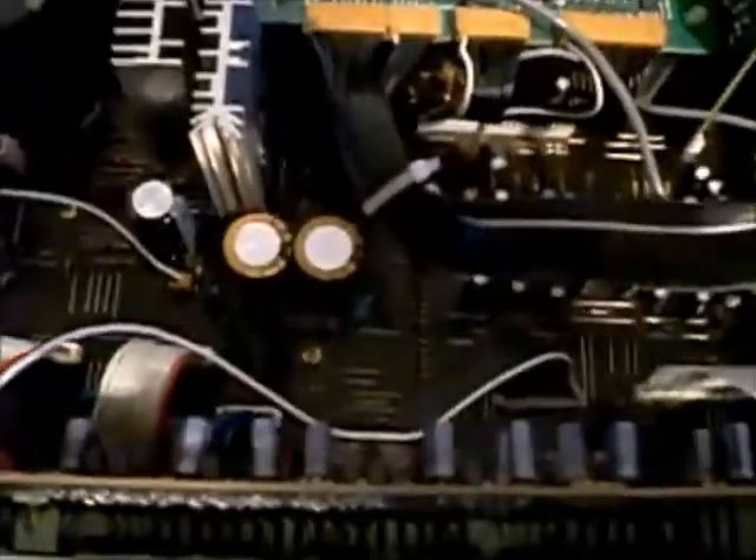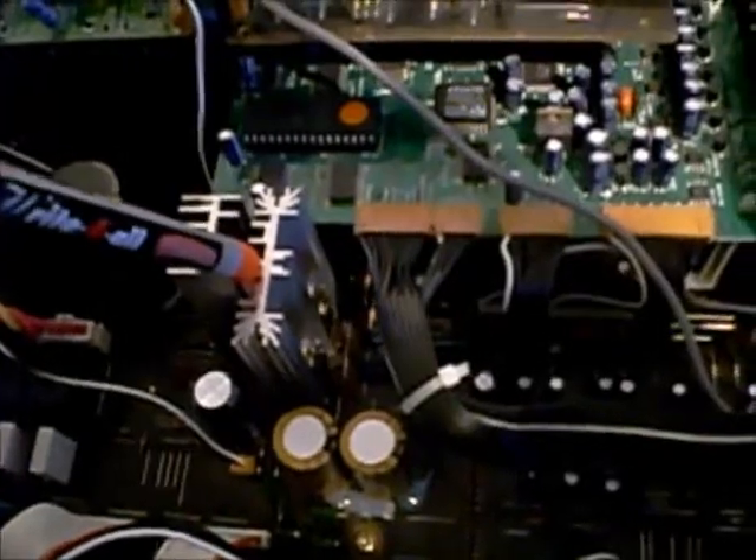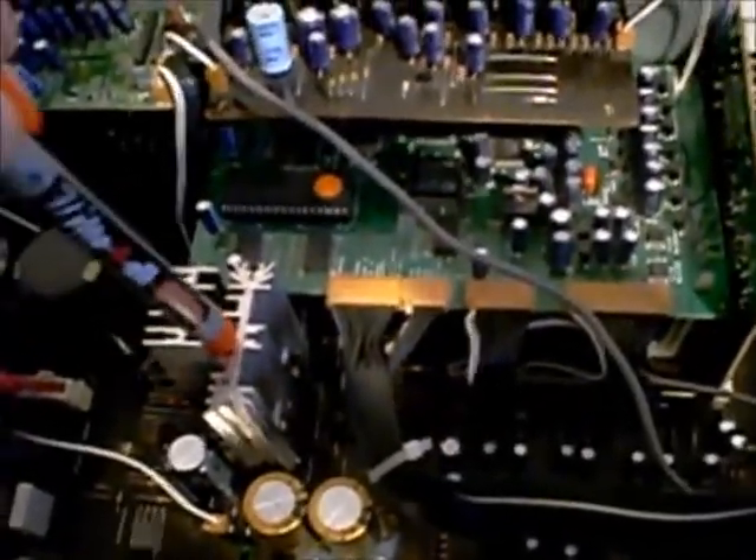It was bad caps due to overheating — actually it wasn't overheating, it was my own fault because it was running in a way it's not designed to. So I think my next job, now it's all working perfectly, is to mount maybe a 40 or 50mm 12 volt fan onto this heat sink here — then it'll stop the heat building up.